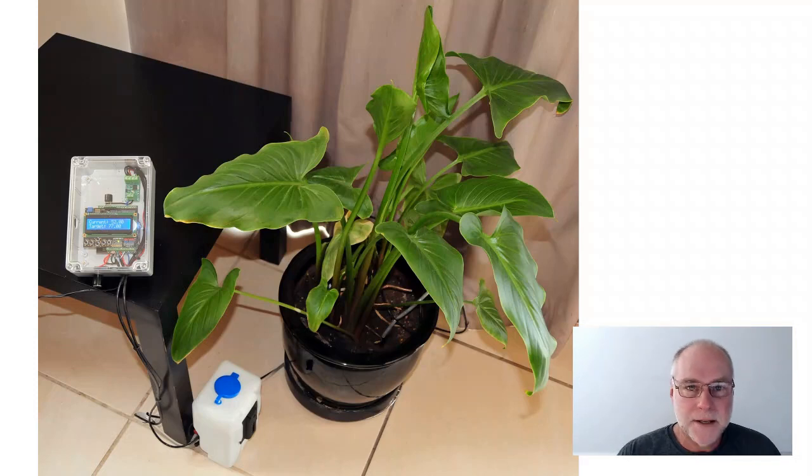And just before I leave you, here's a project I've just finished doing, again for Practical Electronics magazine in the UK. It's an automatic plant watering system, and it's not just as simple as it looks. It actually measures the moisture of the soil. It adds some water via a pump, just a simple windscreen washer pump and reservoir, and then it waits for an hour for that water to percolate through the soil, and then it does another assessment. And the further it is from the set point, if you want 75% moisture and it's only on, say, 40%, so there's a big difference between those two values, the further it is from the set point, the bigger the addition of water. It's a proportional controller, and it actually uses a PID node from XOD.